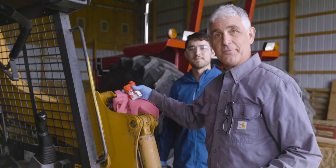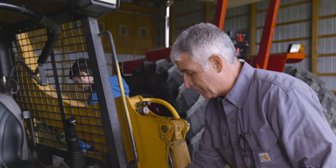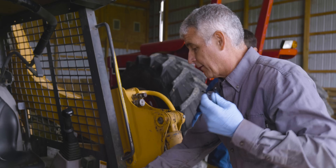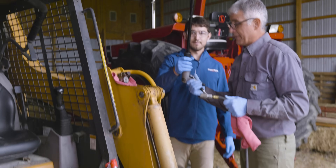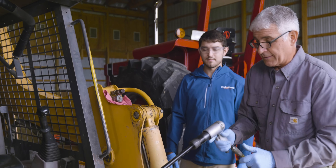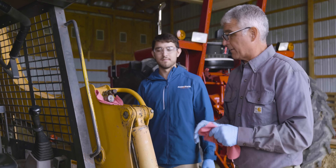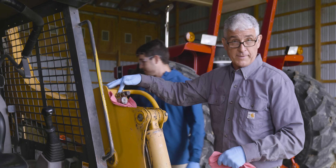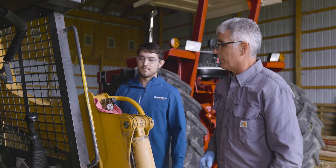So step two: we're going to take the old couplers off and put the new ones on. I'll put my safety glasses on and we'll put a rag under here so when the oil does come out, it won't be too big of a mess. These have a tendency to stick, so we're going to use an impact hammer — the kind you use for taking off fan clutches. First thing we want to do is get in here because there's a locking bolt that you want to keep tight, so we're going to take these two bolts out so we can move the unit forward.